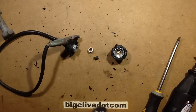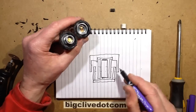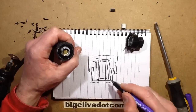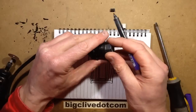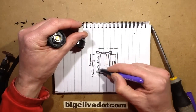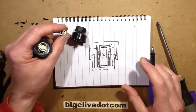So taking a look at this, it looks almost as if it's designed to have double functionality — it's got that explosive charge, but under extreme malfunction or lightning strike conditions, these metal shells overlap. That's probably also to concentrate the force when it does blow up, so it blows the bottom off. It's got a bottom shell with a contact at the bottom, an upper part with a copper contact up there. Under fault conditions, because they overlap, a high voltage could arc right across there as well. Under sustained current flow through the central explosive device, down the middle of this ceramic core, it will then detonate and blow the bottom off. That's quite interesting.